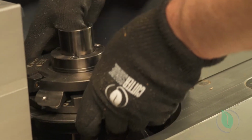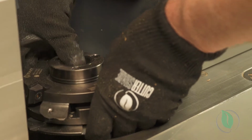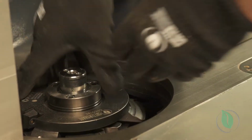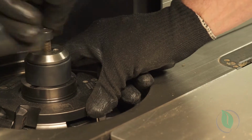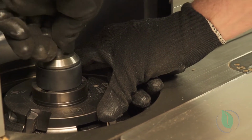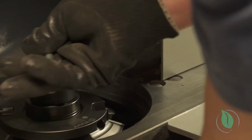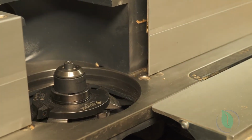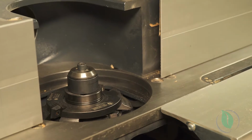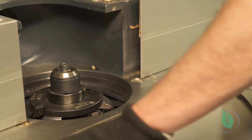For the cope milling operation, mount the cope assembly on the machine spindle, then fill the remaining spindle with machine spacers and fasten the spindle nuts securely. Check the clamping tools and spin them by hand to check that they're rotating flat. Make sure you check your RPM settings and belts for the correct speed range.